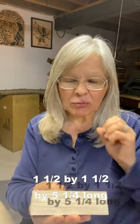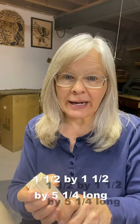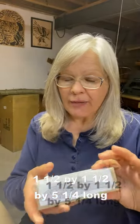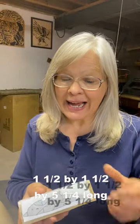This is pine, and if you want to have an easier experience use a softwood like this. It's one and a half by one and a half, and you need to make sure it's sanded, though you don't have to be really detailed because most of the outside is going to be cut off. But you do have to make sure it's squared or it will not operate as a proper puzzle. I've decided to use a little bit harder of a wood — this is poplar. You could use walnut, but go for a medium-hard, not super hard, because an inch and a half is an awful thick board to be cutting on a scroll saw.